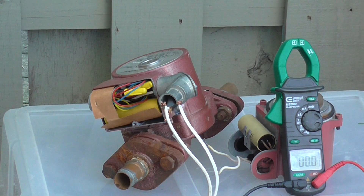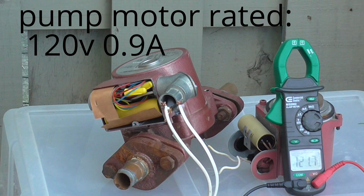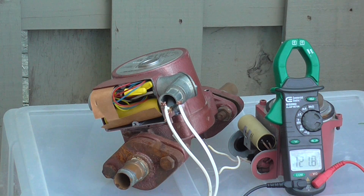Okay, let's see what we get. Now the motor doesn't rotate, so pretty much it's the coil that we're overloading. So there we have 122 volts — sorry about the glare and the annoying bird. So let's begin to increase our voltage.